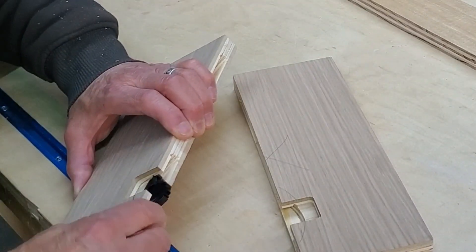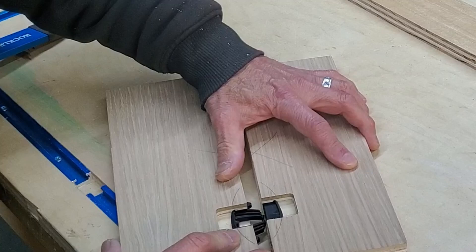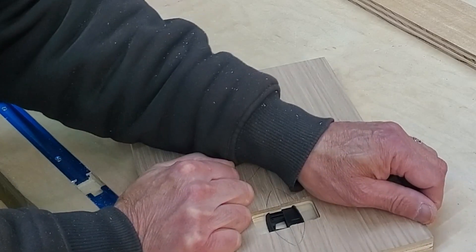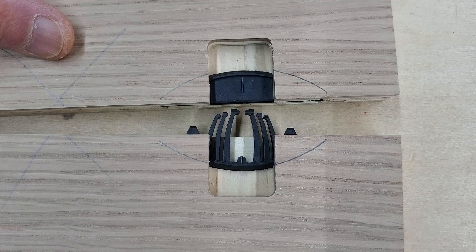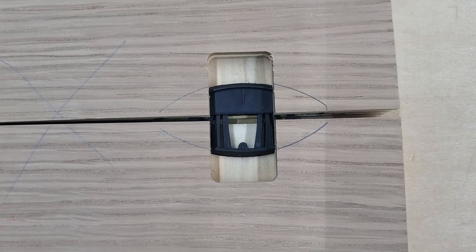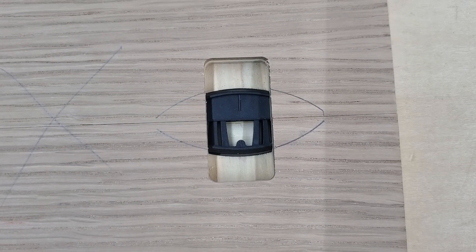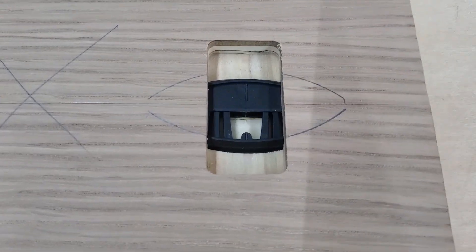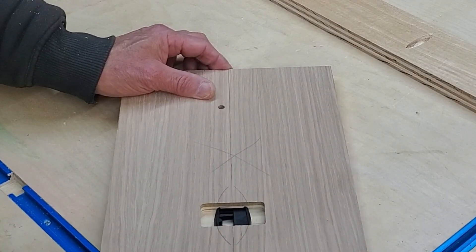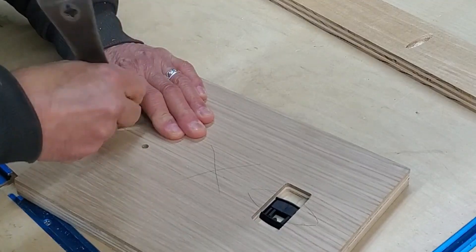Let's check out the Tenso connectors in the slot with the cut-away window. I don't know the exact clamping force of these things, but you don't want to get any skin caught in there when it snaps tight — don't ask how I know. In this close-up, I'm using a clamp to close the joint as slowly as I can, and you can see exactly when those little spring fingers snap shut. Once the fasteners are engaged, there's still a good 16th-inch plus of sideways adjustment, but you have to work fast if you've glued the joint. If you're doing a dry fit before a final assembly, the Tensos will release without any damage to them.